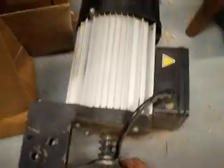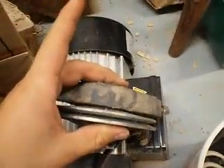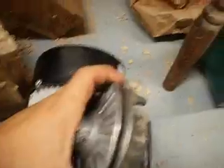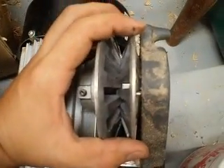I have the old parts here. This is the old motor. You can see this is where it mounted to the lathe, and you can see this pulley — this one just has a spring on it, so it goes in and out to match the one that you change inside. It would be inside the lathe like this. This big black metal piece would be connected to a rod at the bottom through a hole there, pulling that piece which is attached to the right pulley, so that diameter in the middle gets smaller. The other way would push it together, forcing the belt to the outside and making it slower.